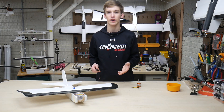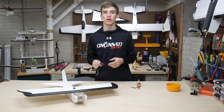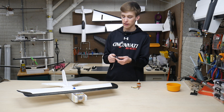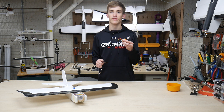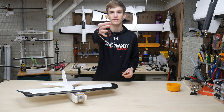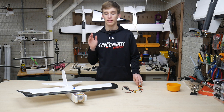Alright guys, it is the next day with the Bloody Baron. You can see it's been completely gutted — my Explorer video is already up showing the reinstall. I've got my ESC in here: this is the Skywalker 40 amp from Hobbywing. These are really nice inexpensive ESCs, and this 40 amp is better suited for this larger 35-36 motor. We've got all the bullets connected, and I've already soldered on an XT-60 connector — obviously my connector of choice. Testing motor direction and we can get this thing installed.